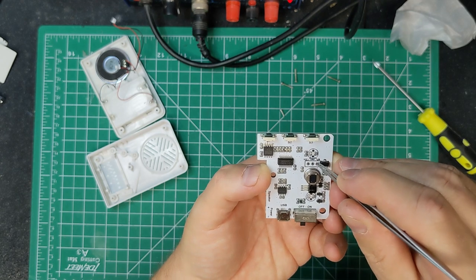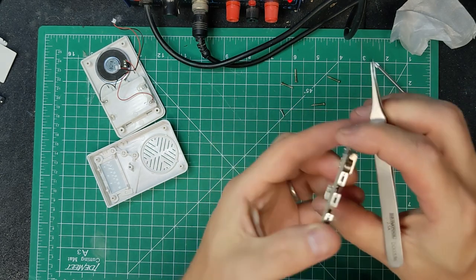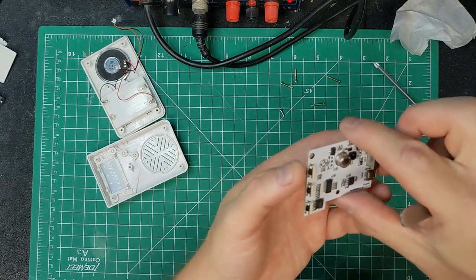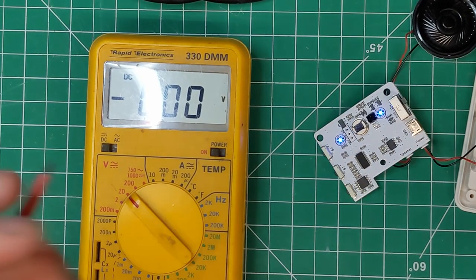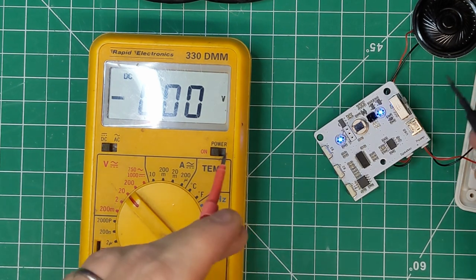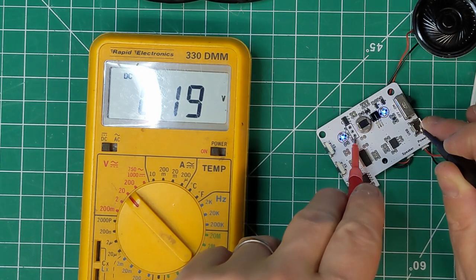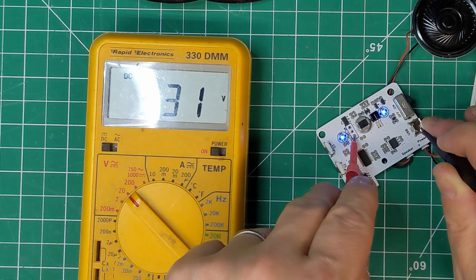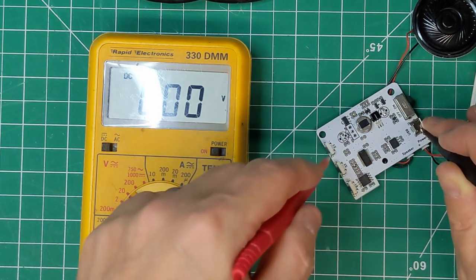Most of the time these PIRs will give you a logic voltage output that changes when triggered. If so, we can tap into that and potentially drive a relay to trigger something else. I'm going to get power back on it via the batteries and then use an oscilloscope to see what's there. I've hooked up the battery box and speaker. You can see that when it triggers, two blue LEDs come on — didn't even see them before, they must be hidden. The USB shell is ground, and probing around I find 3.3 volts, so there's a voltage regulator giving a steady 3.3V to the logic.